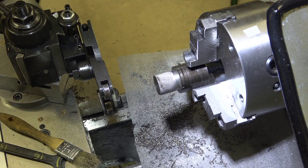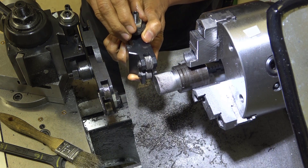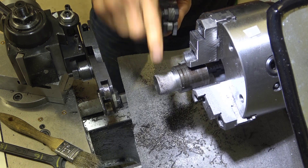I have the push-on type as well. With that one you just have to apply a lot of pressure in one direction, and if you don't apply adequate pressure you don't get a good knurl developing. This result is good.